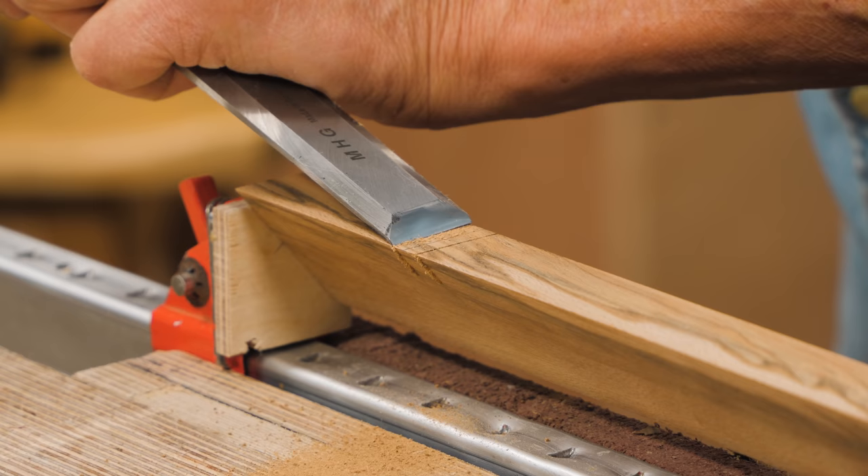Just round it and follow the radius — the same on this side, gently. Now we're going to go with just a flat file. Get as much as you can with the file — this is going to make the plane feel so comfortable when you're using it. That's how it's going to look when this is on the plane: your handle is here, you've got bags of room between your knuckles. It's going to be great.